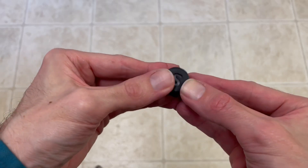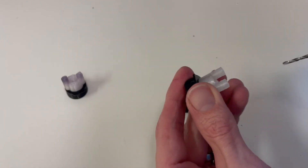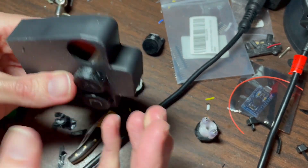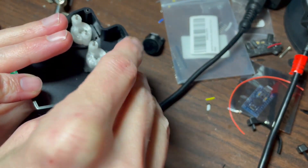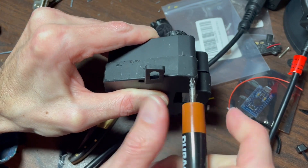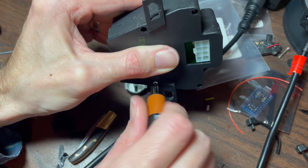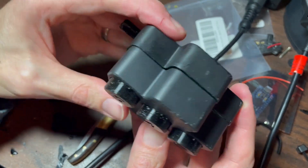I put the two parts back together and drilled out the legs to fit the spring for each button. After doing this, I took all the buttons back to the bench for final reassembly. Note that after securing all the screws, I did have to back out the top two screws a half turn since the tolerance of the buttons was very tight. Sanding the legs would have also fixed this.